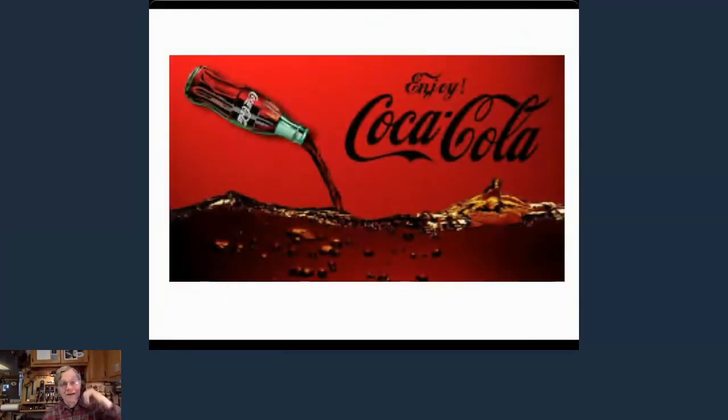When I want to save the patination on the tool, I use Coca-Cola. Take a couple liters, put the parts in a plastic tote with a fitting lid, cover them with Coca-Cola, and walk away for a week if it's really rusty, or a couple of days if not. The phosphoric acid — which is the flavoring in Coca-Cola — will dissolve the rust without taking any excessive material and without changing the patination. When you take it out, wash it off, clean it up, and oil it down immediately — the patination will be there and the corrosion will be gone.